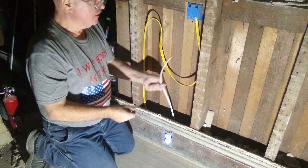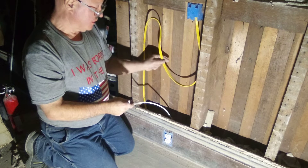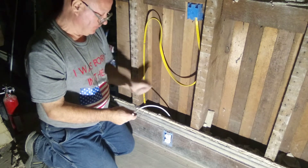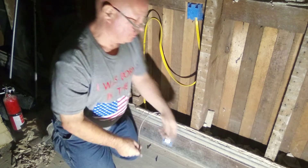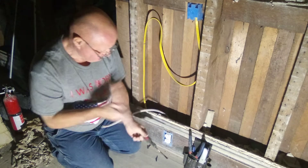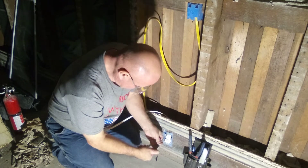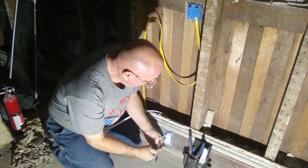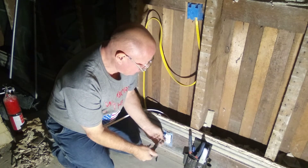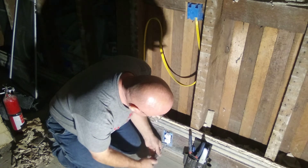This was the wire feeding the kitchen outlet here. We ran our 12-3 up to the kitchen, so we have two circuits in here now. We're going to disconnect the others and take this wire out of here that was feeding the kitchen circuit. The kitchen has to be on its own circuits — you have to have two circuits in a kitchen with number 12 wire on 20 amps.